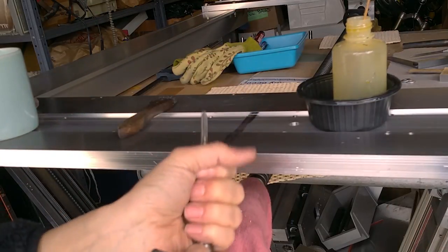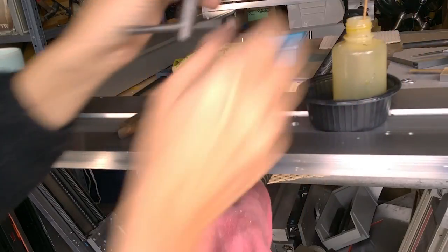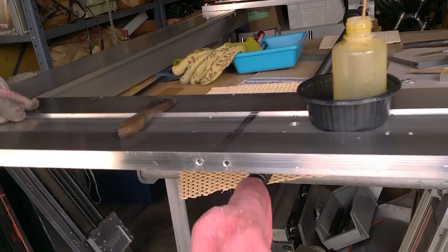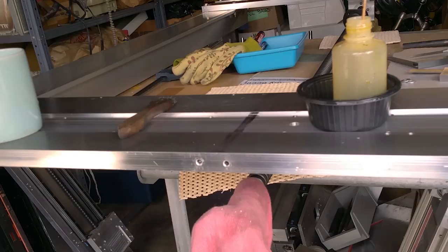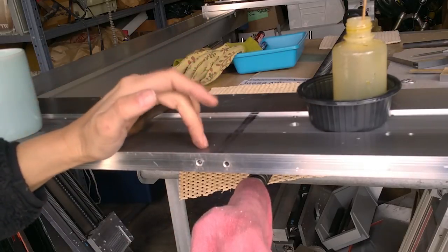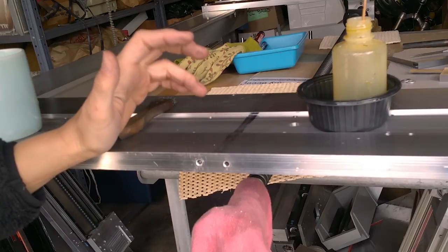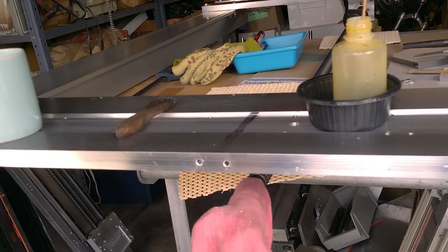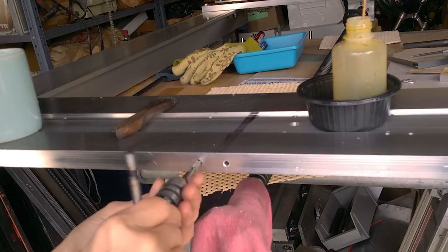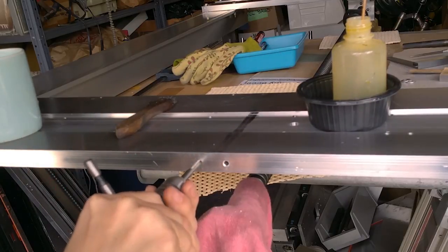And I've got a 6mm tap, and plenty of oil. I've got a cup of coffee over here too, and I'm just going to take my time and do this. I've got a comfortable chair. I have something to catch some of the chips. I've got a rag over the end of the ball screw so all the chips don't fall into the bearings. And yeah, so I'm fairly comfortable. I got the camera out of the way. And here we go. Now try to get it straight.